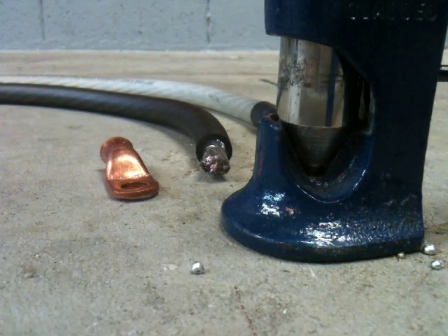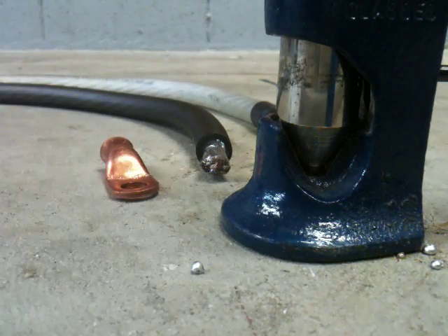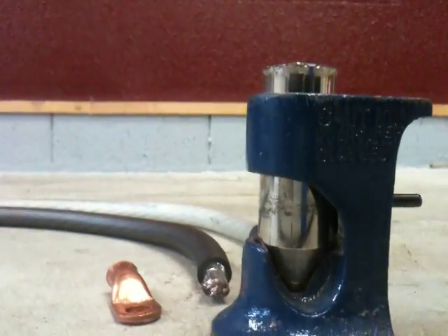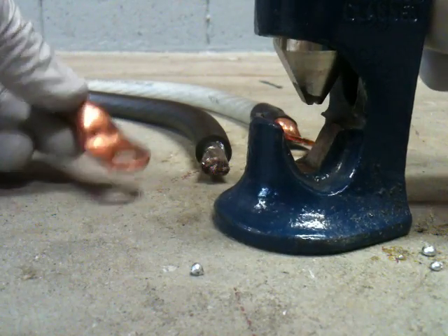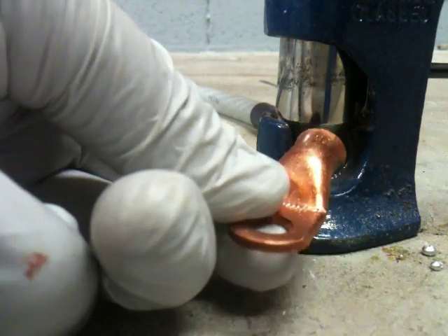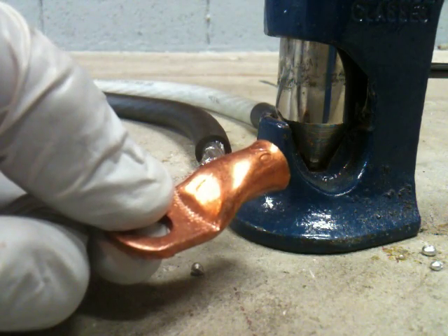The downside to it is it kind of makes a mess of the terminal, and if you're working in an engine compartment or something like that, it's pretty hard to have a nice solid base to where you need to hammer down and create the pressure needed to smash this thing down. It's pretty archaic — sort of like a guillotine. This thing gets raised up, the crimp gets dropped inside here and then you just smash down on it. It's also pretty inconvenient if you're working inside a boat — you don't want to be putting this on the fiberglass floor and hammering down.